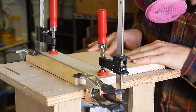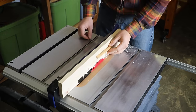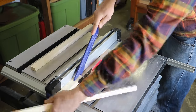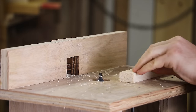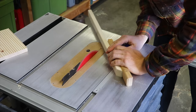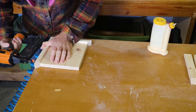Eventually there wasn't enough room for another groove, so the remainder was trimmed off on the table saw. A raised border will keep the crayons from sliding off. I ripped a board to the height of my raised border. Three of the four edges along the length are rounded over, and the non-round over edge joins to the bottom of the tray. The border pieces are mitered like a picture frame with the miter gauge, and wood glue and brad nails work really well for mounting the border.